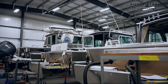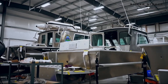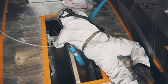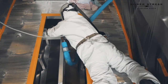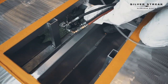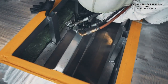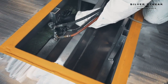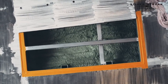Silver Streak boats are built with safety in mind. We have many safety features that can be added to the base model when customizing your boat build. As a standard, our vessels come with a specialized spray and foam flotation. This particular foam is a closed cell marine grade foam which expands and adheres to cover all target surfaces. The foam is strategically placed on hull sides to maintain level flotation while also avoiding waterways or drains in order to circumvent foam saturation. The quantity of foam used is based on a set calculation and varies from size and model of boat.